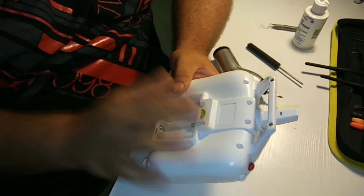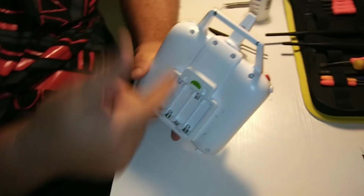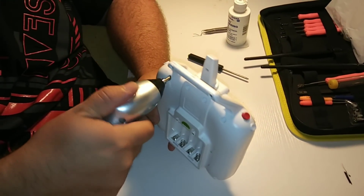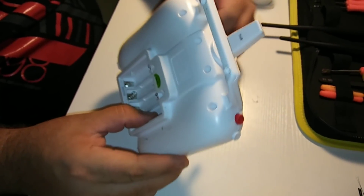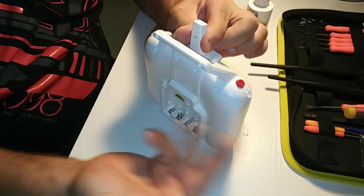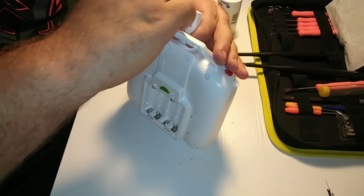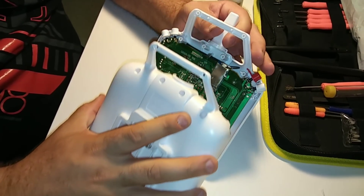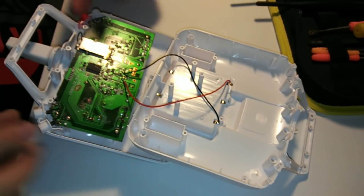We still have to clean the silicone off the transmitter — it's almost identical to the other one, done exactly the same way. But first we take out all the screws. Backs off — just be careful pulling it apart because all of these tabs are going to fall out. It's okay, they're really easy to put back in. There's also a wire attached to the back of the tray which you don't actually need to remove entirely.